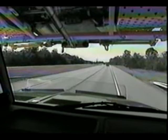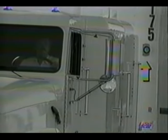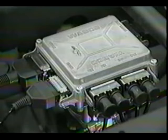Prior to March 1, 1998, the ABS warning lamp may be mounted on the front left corner of the trailer. The warning lamp on these trailers may also work differently than those on newer trailers. We'll explain some of the differences later. Now, let's discuss the possible faults the ABS may encounter.